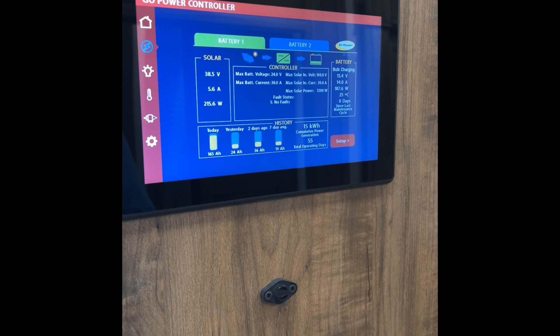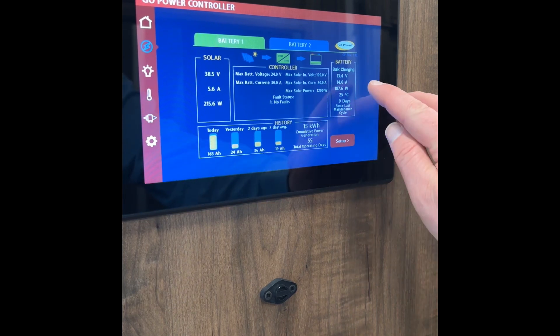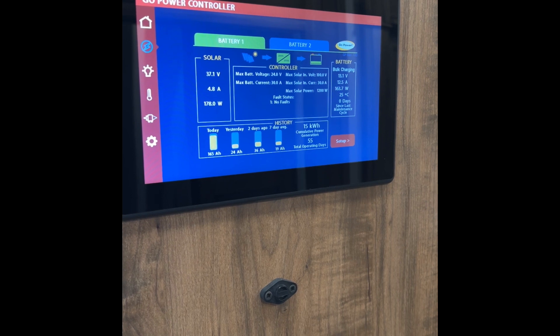So this is where you'd find all those readings and exactly what the system is doing. How much is this making a difference? Right now we're showing 14 amps. If you turn your inverter on and look at it, you'll actually see how many amps are being pulled out. When we're up around that 13 to 14 amps, we are actually putting in just about as much power as what the refrigerator would be using on a regular day.